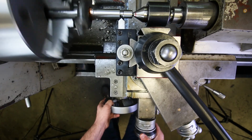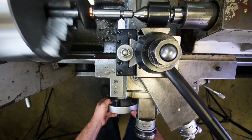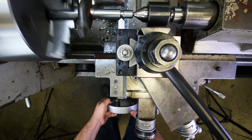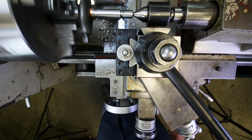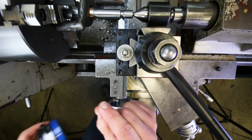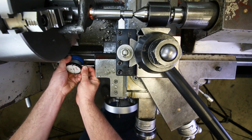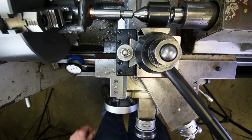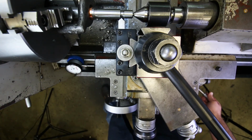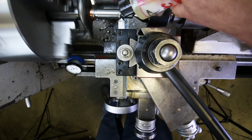Now we're going to have to go a little bit closer, I think. Okay, touch off. Nice and slow. All right. You only have to just shave that corner to touch it off. Don't touch off too heavy. Okay, this is set at 0. We can turn this on. Tap magic.